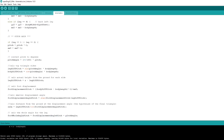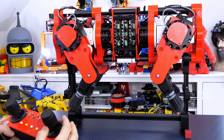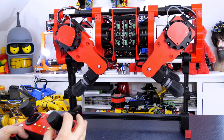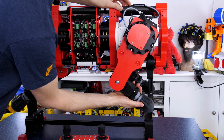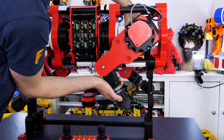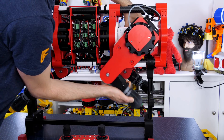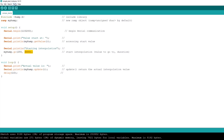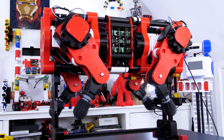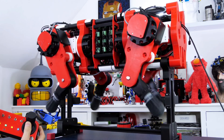Since the left and right and front and back legs are mirrors of each other, there are various points at which the calculations get reversed, but avoiding divide-by-zero errors and trying not to break the maths with negative numbers in the wrong place is important. Although we can now position the feet in XYZ Cartesian coordinates, when I do this manually I'm essentially scrolling through all the waypoints between start and end positions as I move the control sticks, which makes the feet follow a nice smooth path. But when planning a series of motions to make up a walking gait we need to automatically interpolate between waypoints, otherwise joints will move at full speed causing some to arrive sooner than others. To do this I'm using the Arduino ramp library, which will interpolate between two positions over a specified time and fill in the waypoints between start and end, resulting in nice straight lines drawn by the feet.